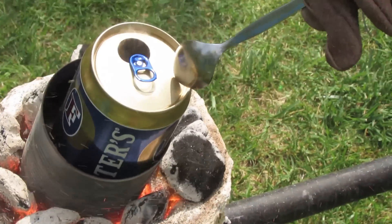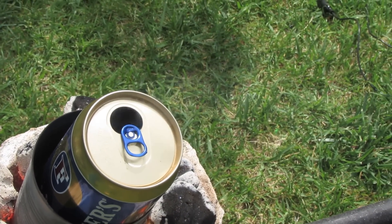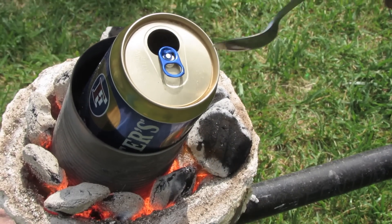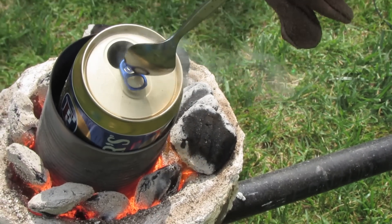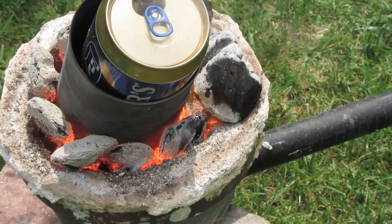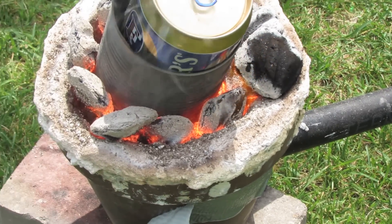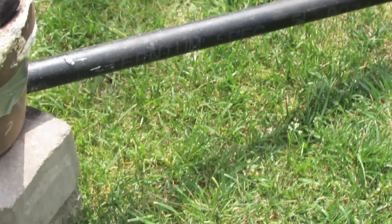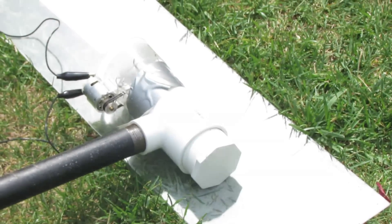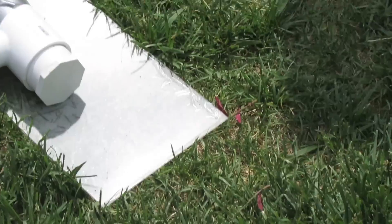Here's a really big can — alcohol smell in it. So I just have a flower pot and I made up some refractory cement and coated the inside. I drilled out a hole with a Dremel, put the iron pipe in, and there's just a PVC little T on there that goes from one inch to two inch where we put the fan in. It's just duct taped in there — it's working great.